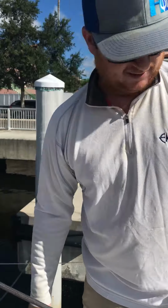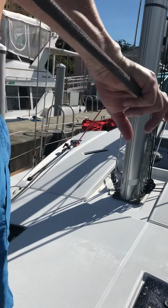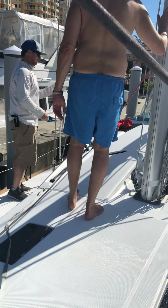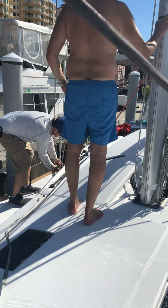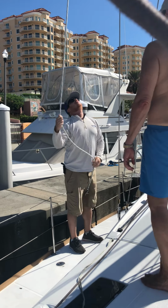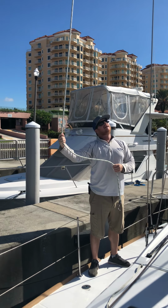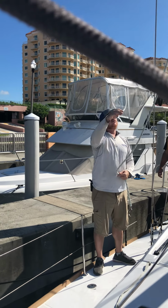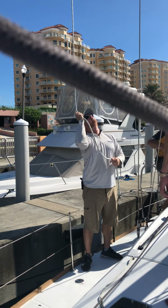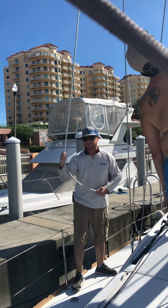Okay. So your halyard, you've got clipped down to your chain plate. So what we'll do is a little slack in there. No, we're good. So first thing you do is make sure you look up and it's not inside something or crossed, so you just want a straight shot right to the top. So you see that? Yep, I can see it up. Looks pretty good to me.